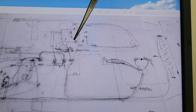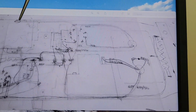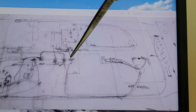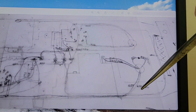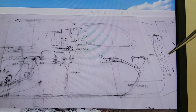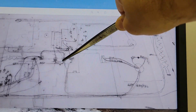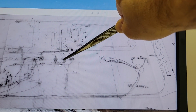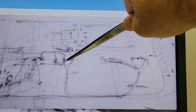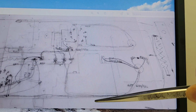So from one of those, we go to the choke. This is the choke over here. Out of the choke, then we come over to here, and then we've got one wire going all the way over here to the first of these dropping resistors, going through the one dropping resistor, through the second, and then back over to this terminal. So that's our B1, and then another dropping resistor and our B2 right here. And here are the capacitors that go with all of that.